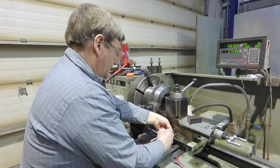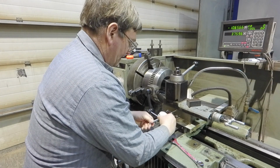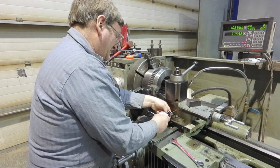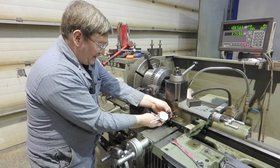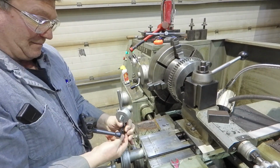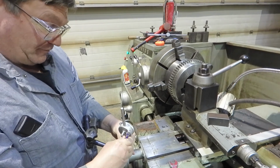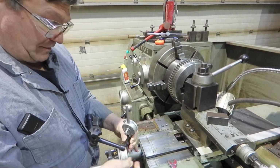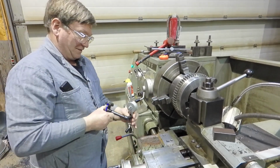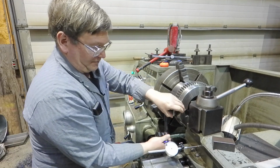And tighten that up a little more there. So since we're at, this holder's wonky. Some of these do that. They get to where you can't tighten them all the way. And what that is with these Noga holders is this little nut back here backs off. So you're going to back off the pressure, and then this one here is kind of loose. And you just reach in. There's probably a tool for it that I don't have. And you can tighten it up a little bit. And then when you tighten up your lock, it will become more rigid. It's kind of amazing that quarter of a turn made so much difference on it. Normally I've got to turn them a couple turns before they come somewhat tight.